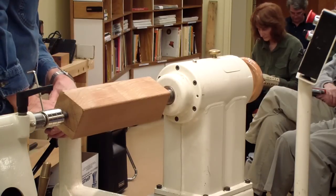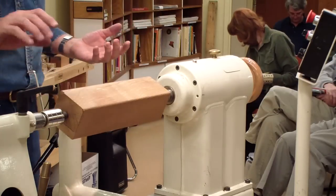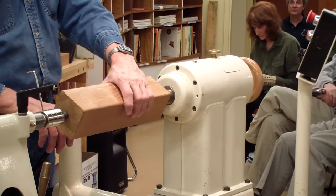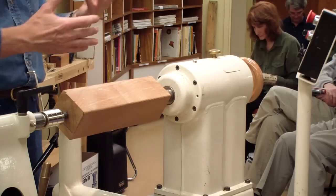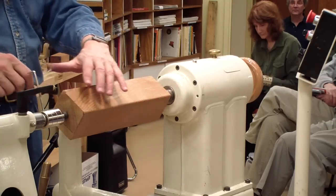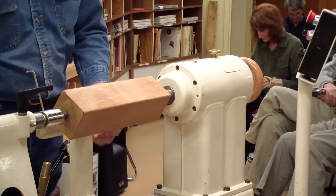And if you're going to get into this, I left my leather glove at home. Get a really good heavy-duty leather glove, a smooth piece of wood, and a fistful of wax. Just hold it on there until you can't hardly hold it anymore. You'll fill that leather with wax, it'll polish it down, and it'll harden it, all the solids will go away. But from then on, you can hold your wood without contaminating it severely. So then, once you hit it with sandpaper, it's clean. And it's really worth doing.